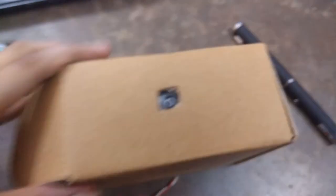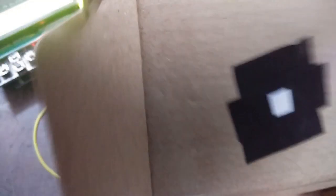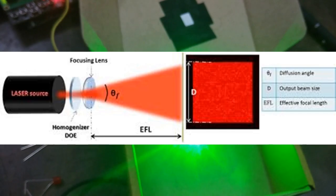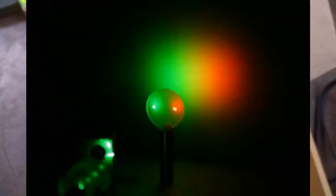This is one way of measuring using the lens. There is also another way using not a lens but a diffuser, which spreads the light. Why do I need to spread the light? If the laser is concentrated directly over the solar cell then the solar cell can get ruined or burned in a particular place. Hence I either need a lens or a diffuser to diffuse that part of the light.